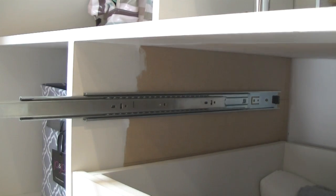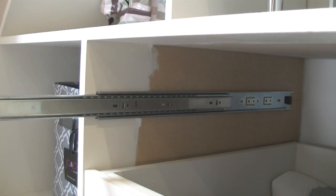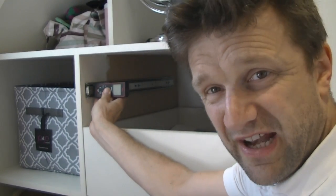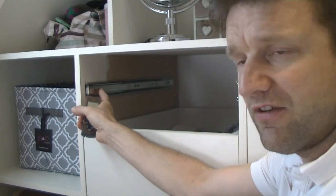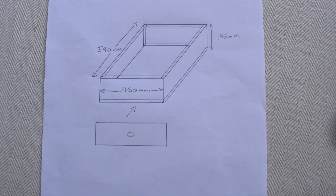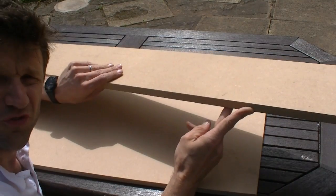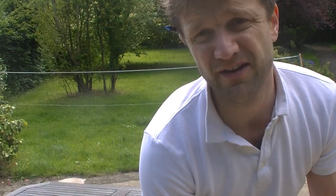I've used these ball-bearing drawer runners — I love them because they extend a huge amount and they're reasonably cheap. Full information on where I got them will be in the description. I screwed the drawer runners into place, then used my laser measure to accurately measure the inside distance from one drawer runner to the next, front and back, to check they're the same — that gives you your drawer width. I always construct the base of my drawers from 12mm MDF and the sides from 18mm MDF. I cut two strips for the sides and two for the ends using my saw, then plane them level.